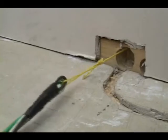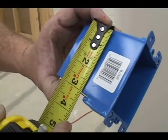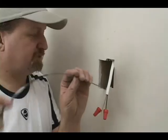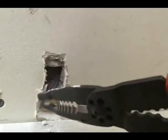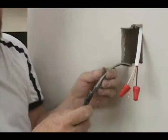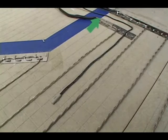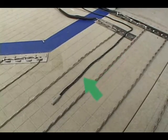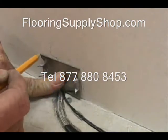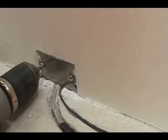Pull the string through the wall and retrieve the power leads. If the drywall is already installed, locate the stud, mark its location, and cut a hole for the electrical box. Cut another opening directly below the control location. Feed either the fish tape or a string weighted with a nail down to the hole. Retrieve the end and attach both the power lead and the sensor wires to the string or fish tape. Pull them through the wall and out the top hole. This is much easier to do before installing the electrical box. Notice how the sensor wire runs between the power leads and doesn't come in contact with or across the heating elements. Cut the label off the sensor wire so it doesn't stick up. Draw a line around the nail plate where your power leads go into the wall, remove a layer of sheetrock, and secure your nail plate in place with screws. This will protect your work against trim carpenters.